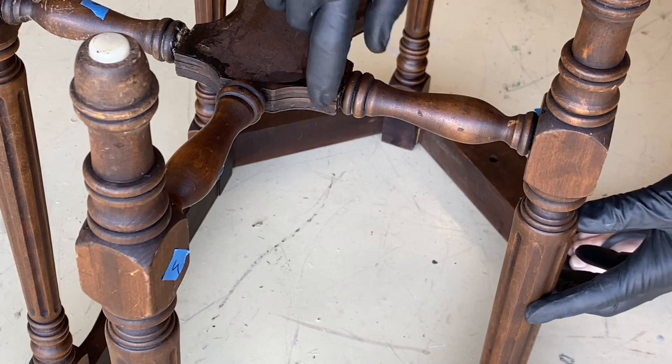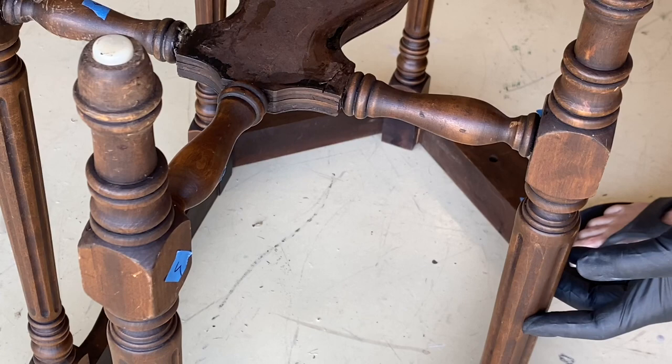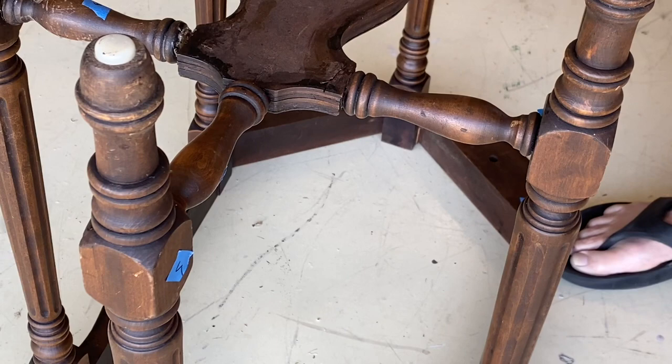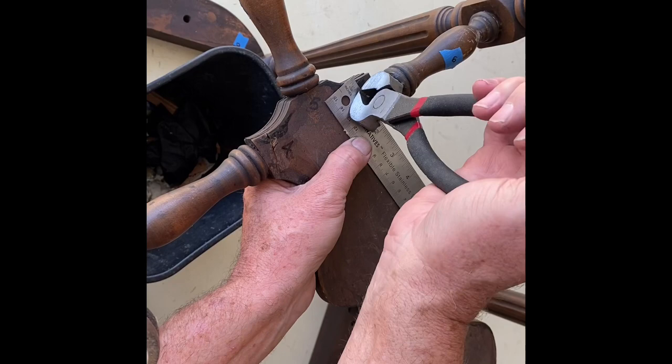The other thing I have to deal with is this plywood. The plies have shrunk and expanded, so there are a couple of loose plies and some have grown proud of the surface. I'm going to sand that flush using the spindle sander. I'll take this thing all apart, get all the spindles loose, and clean it up. There are some small nails driven in through the shelf to secure the tenons on the spindles — I've got to get those out, but they're just breaking off.